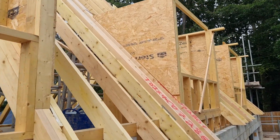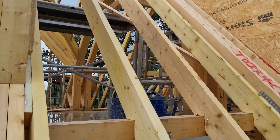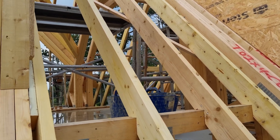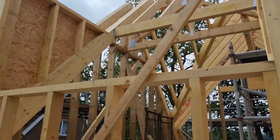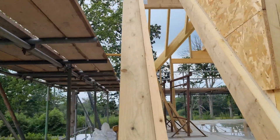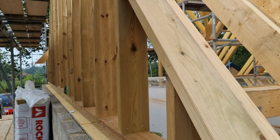That's the basis of this hybrid roof. The beauty of it is you can eliminate the steel and it's fairly cost-effective. The timber we use is called TR26 — truss rafter 26 — it's not eased edge, it has a square edge, which I particularly like when cutting intricate rafters because when marking lengths you can get it exactly right without allowing for the rounded corner you get on eased edge timber.